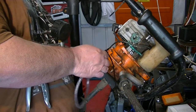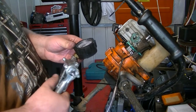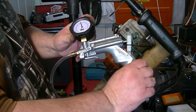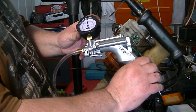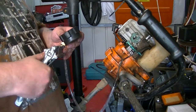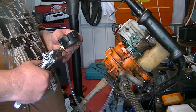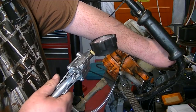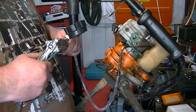The only thing I haven't brought down is my soapy water. It takes a little while to pump these up — I'll just get the gauge reading. I can't remember what the pressure is on these tanks — I think it's about seven. It's going down, turning back to five, it's going down, down, down. It's definitely leaking somewhere. You have to check the system first — the bits you put in — and then check it. Yeah, we're dropping right down to zero.